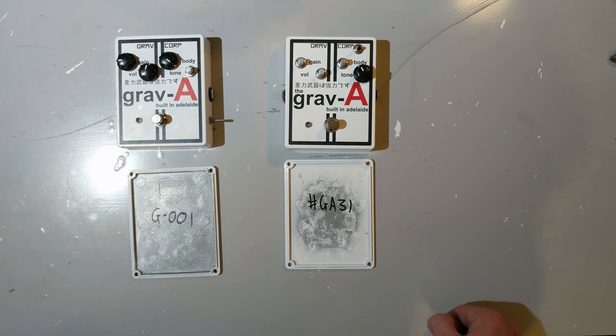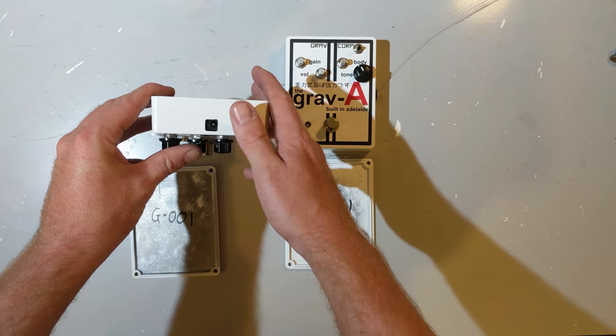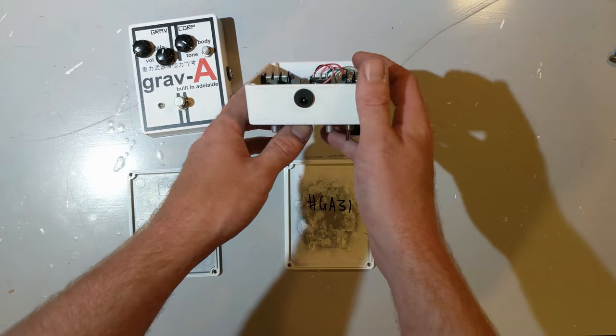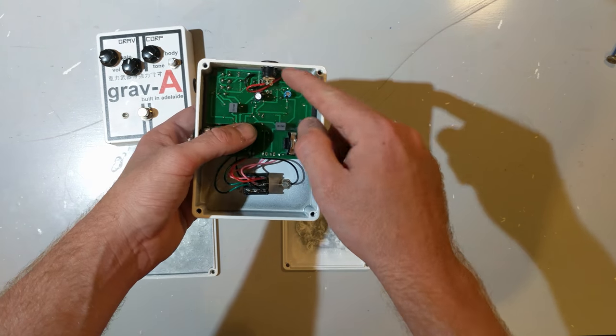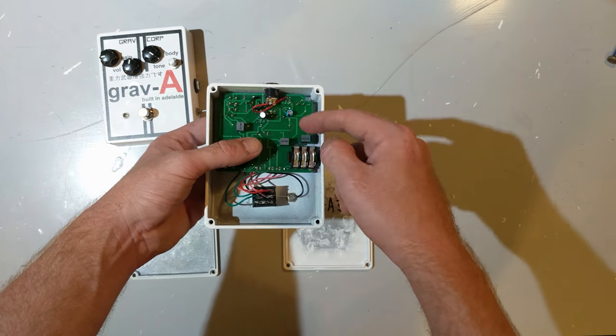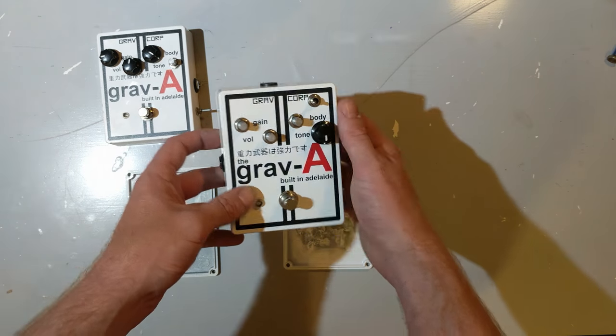Now, the first thing that was freaking me out was the barrel jack. Simply, I knew I couldn't ship something out at a reasonable price looking like this. I switched to a round barrel jack. When I got the Rev 3 cases, I also realized I couldn't actually get the nut on the back. So for production purposes, I would push these through, solder them up, and use epoxy to hold the jack in place. And that worked excellently.